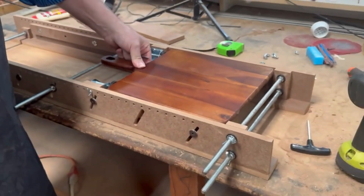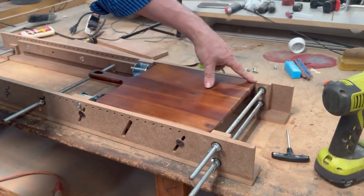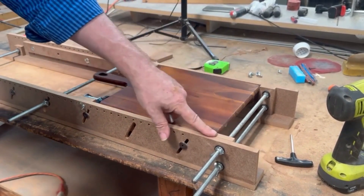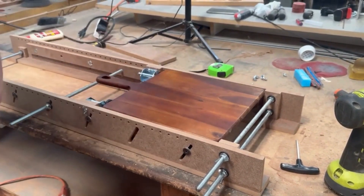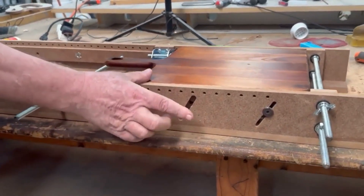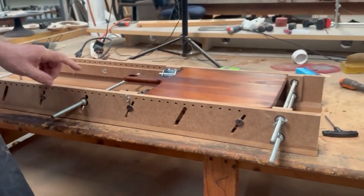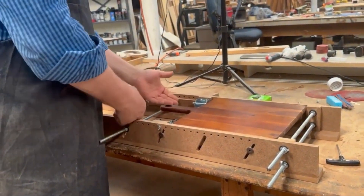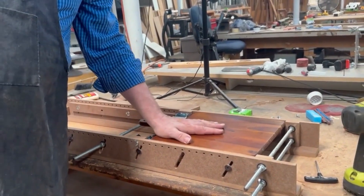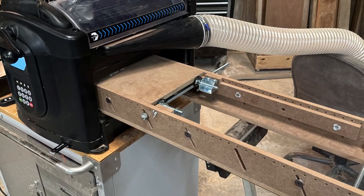That makes your board very well secured — there is no play, no way it can move around. You're anchored up here to three and a half inches from the head. It's a good idea to go ahead and measure your jig to know exactly what your measurements work out to. Also note there are additional slots here and here that we can shift this rod to, if it's in the way when clamping or you need additional support. Then insert the jig and run the project just like you would any other board.